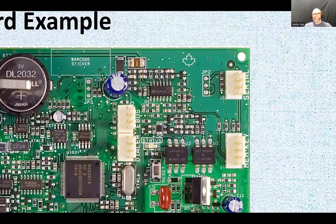Also, what you can use this for is connecting something called the IP module, Internet Protocol module. On one end, it has a little tiny cable that plugs into it, and the other end of the cable plugs into the serial port. It's almost like an ATA adapter for phone systems, but this one is connecting the alarm system. So on one end, it has the cable that connects to the serial port of the alarm system, and on the other side, it just has an Ethernet jack, just like a computer jack, so you can connect this whole thing to the network. And then you can still program this system with your laptop, but you don't have to connect it to the serial port. You just plug the laptop into the network, the LAN, local area network, that this thing is on, and you just have to follow the proper instructions of how to access this particular equipment, right?